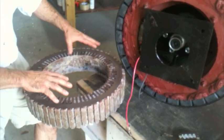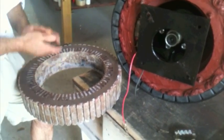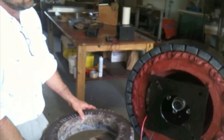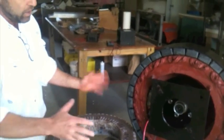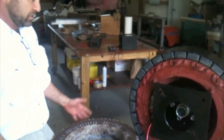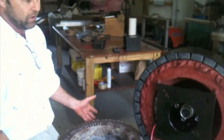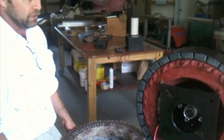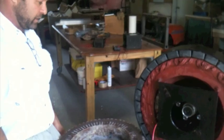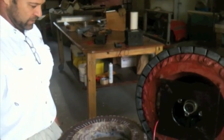By having a small amount of iron in it, you have a quicker, easier start-up. This generator is designed to turn in very low wind and put a lot of output out when the wind does pick up. Most windmills out there don't even start turning until 8 to 12 mile-an-hour wind and produce very little until you get 20 mph. Most people don't have 20 mph wind all the time — they may have 5 mph. This is going to give you something in a 5 mph wind.